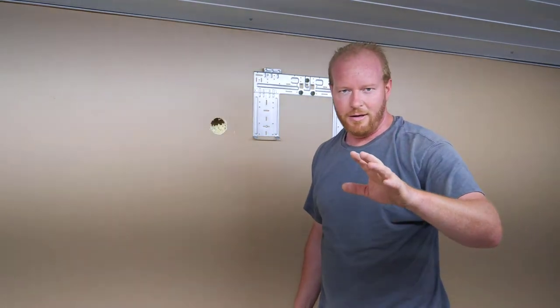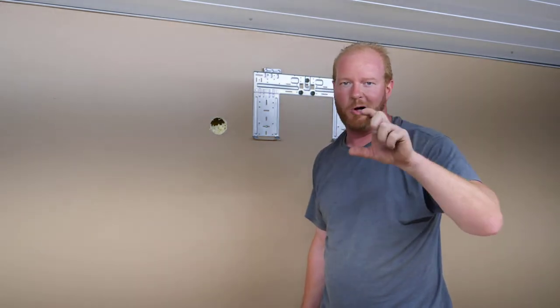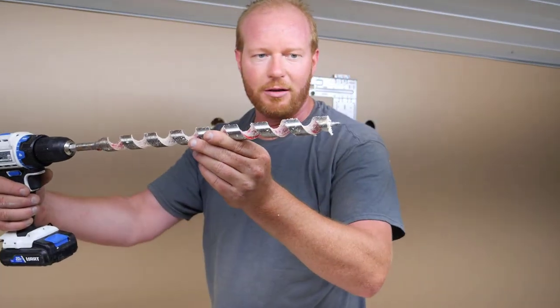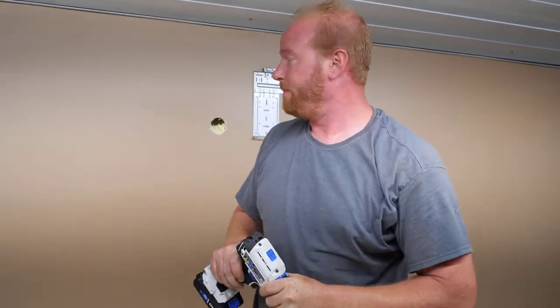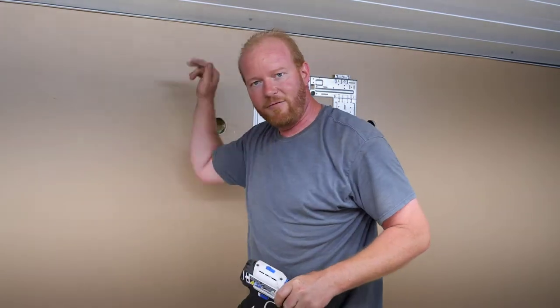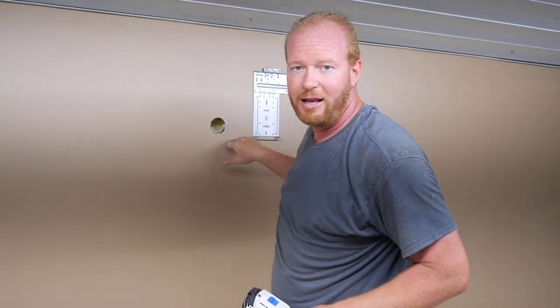It's gonna get messy. So I went to the attic, and I have 5 inches of foam. I need to get 2.5 inches of that foam hogged out so I could get to that hole. So I used a big old drill bit and just stuck it down in there and ran around a little bit. And I was able to get that hole cleaned out enough that I can see from the attic down through that hole. So now I can get my line set through there.